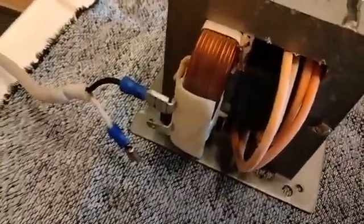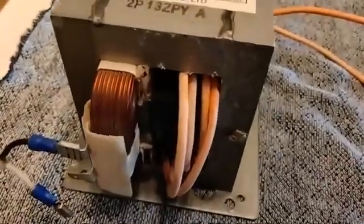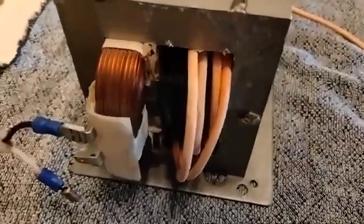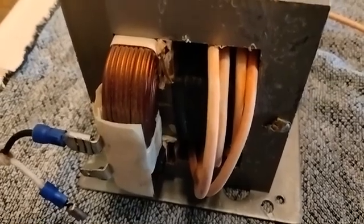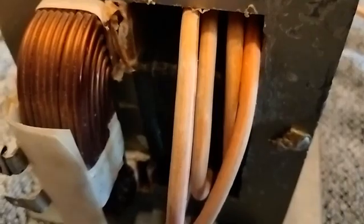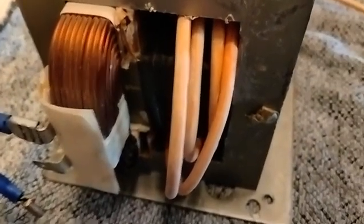The transformer is not going to hum anymore, it's not going to get hot anymore. The windings aren't going to get hot. The tube is going to be lit up with four volts, five amps, but it's going to work right. So forget about the hundred-odd other videos telling you to just wrap a secondary — you have to fix the primary to make this a proper transformer. You're going to have to add 40 to 50 wraps of magnet wire in the same direction, going down and in and back out the top. I'll be back in a few minutes.